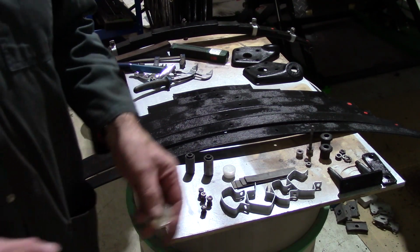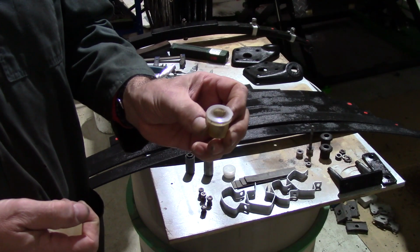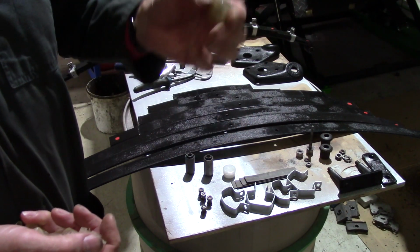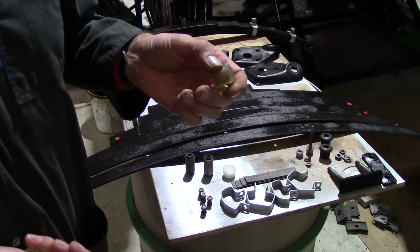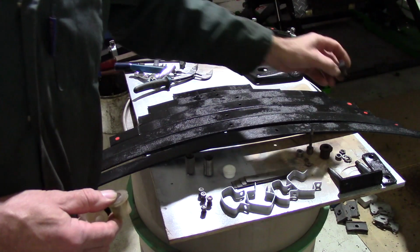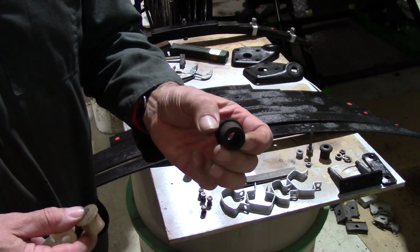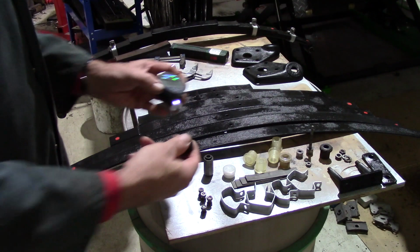Right, so onto the springs. I've done the bushes, so they're all done. I had to do eight, I was mistaken. The swinging shackle mount in the chassis is not phosphor bronze. It is on the Mark 1, but on the Mark 2, they switched to rubber bushes. So those are what goes to the chassis and the same bushes in the springs. So I've got all the bushes done.